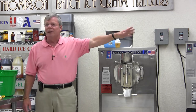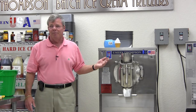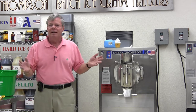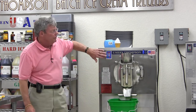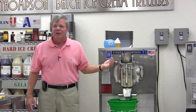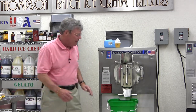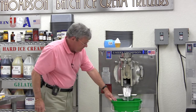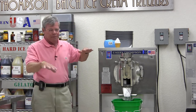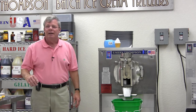The second this sterile water hit all the parts, everything was clean. But your health department is going to say run it anywhere from 30 seconds to three minutes — whatever they say is what you do. When we take ice cream out today, we're going to leave this spinning, turn off the refrigeration, and it's going to push all the ice cream out. But the water is so loose that if I open this gate right now, the first 30 people in the front row are going to get a bath. So we turn off the beater, open that up, and it will drain out. The barrel has a slight pitch forward so any water left in it is going to come out. If I follow directions exactly, I'd be finished and could start making ice cream — but since I don't follow directions, I'm going to throw another rinse through here.